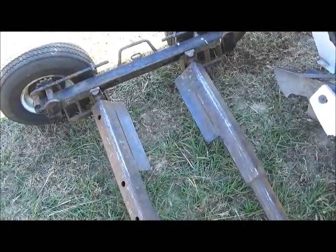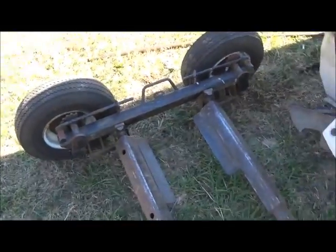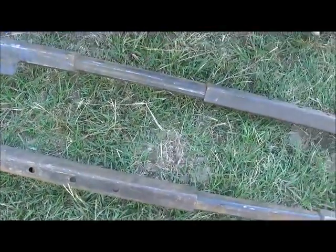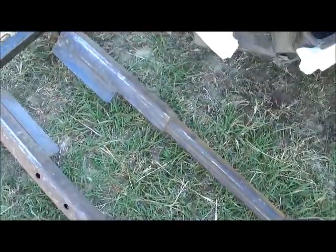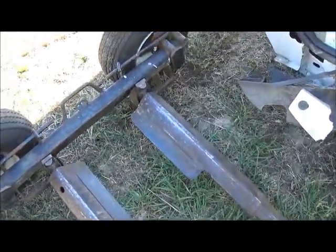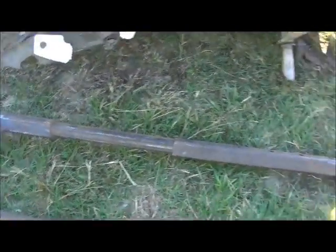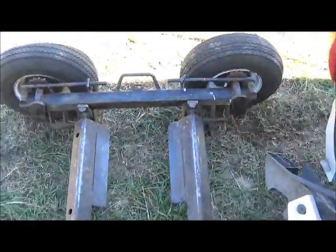You'll struggle with it every time and the tire will be dragging the road. At a wreck you want to keep things rolling as good as you can — the side of the road is nowhere to learn this. You can actually pin them; I've never done it, don't know anybody that does, but they probably recommend it. They also recommend strapping them down — you can come up with a loop strap around the tire, suspension, anything you need to do. These are light years ahead of the old pan dollies.